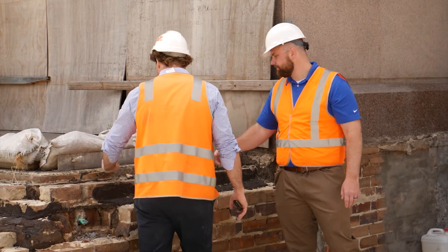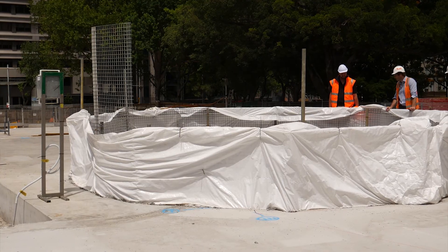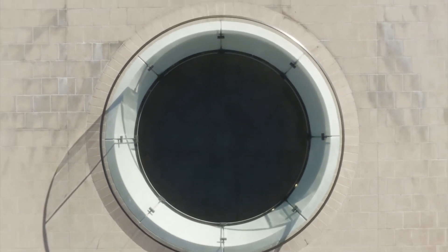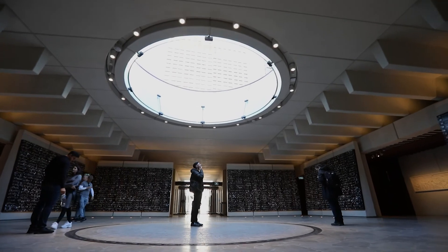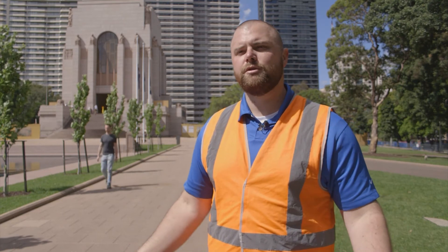A lot of these were happening in real time. One day we sit there and say, oh, there's a wall here that is not in any of the previous drawings. How do we detail that wall, or the obelisk area in the center? There were no drains on the floor in that room because it's an internal space. So then there were questions about — technically it's internal, so does that fall under the external waterproofing standard or the internal waterproofing standard? We had to have a bit of a play there to make sure everything was compliant with the building code, and to make sure everything material-wise and installation-wise was going to be deemed acceptable for our warranties.